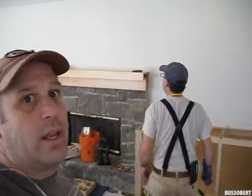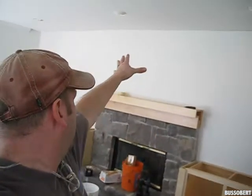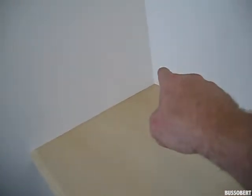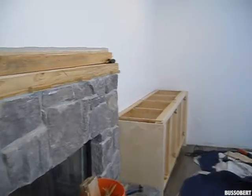As far as crown, we're doing that later — or I don't know what the homeowner is doing. So we're taking that off and that's all going to be maple up there. Here we've put the countertop on. We scribed it to the wall because there's going to be no backsplash, so we had to scribe it to the wall. This one's installed.